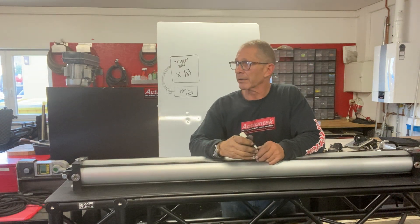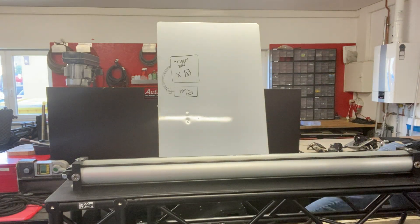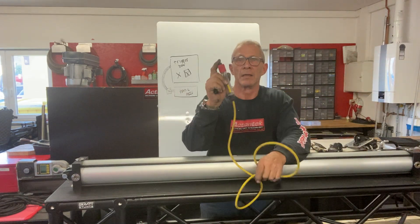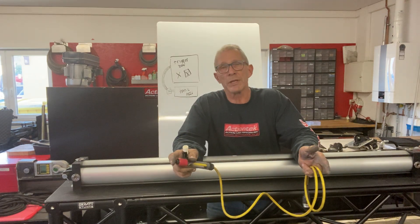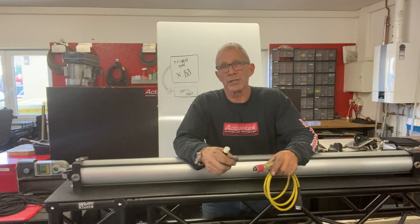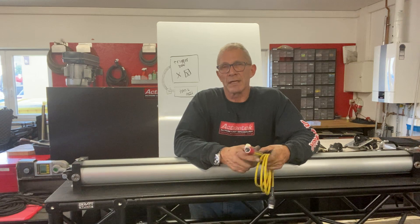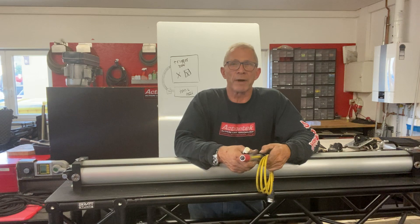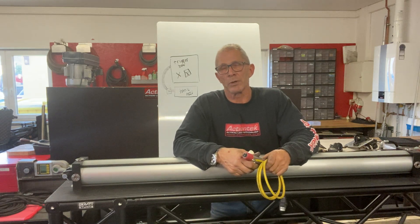This box has valves that turn on and off at the push of a button. There are buttons floating around here. So you have a button — it plugs into the box. When it's powered on, you hit the button, the ram strokes out. We use them incorrectly in a sense — we use them normally with the push as the stronger stroke, but that requires building stuff that stunt guys don't have the skill for, and it complicates things because they have to be fixed in a rigid frame. In the interest of simplicity, we use them on the pull stroke only.